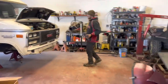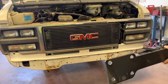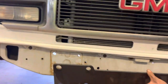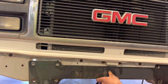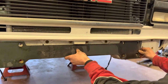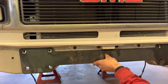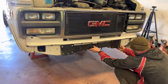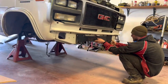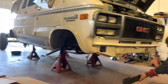Dylan's all worried about the hole size — they're a little big, but we're going to washer it up and I'm going to be welding this on. Maybe they are big holes, but it's okay. Like I said, I'm going to weld this to this. There's the plate to start building the front bracketry off of — quarter-inch plate. I'm going to call it a W.